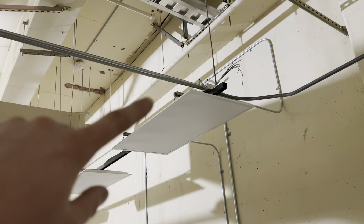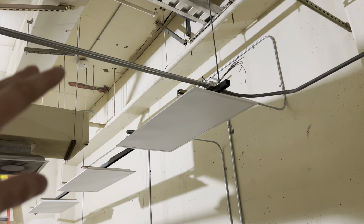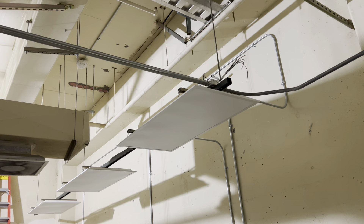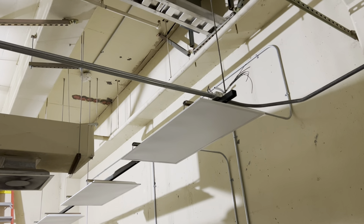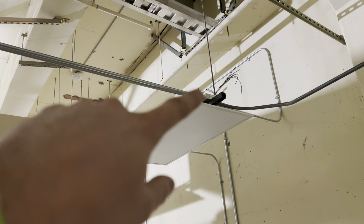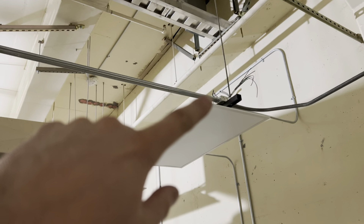So I just did the black, red, and blue circuit. Still have to pull like another couple blue circuits and some red circuits, as well as the traveler wires. And I accidentally pulled a black for the switch leg instead of the pink. So I'm gonna have to switch the black out for the pink wire that's up there.